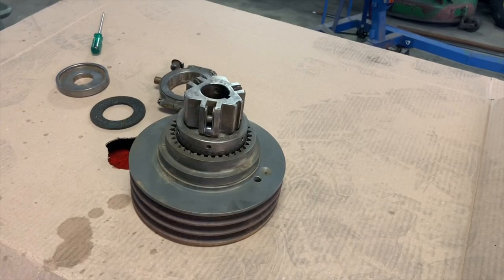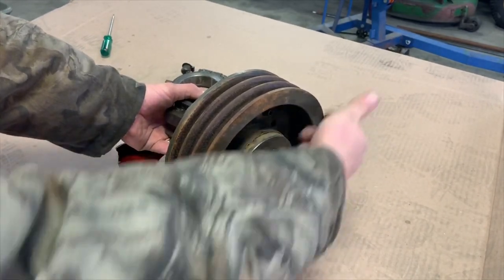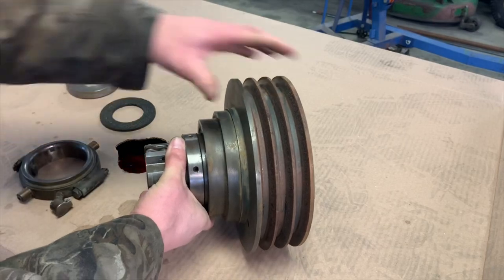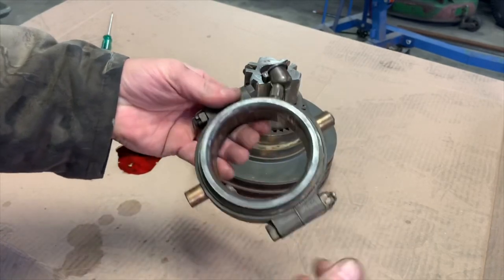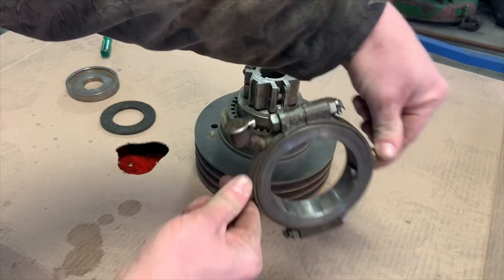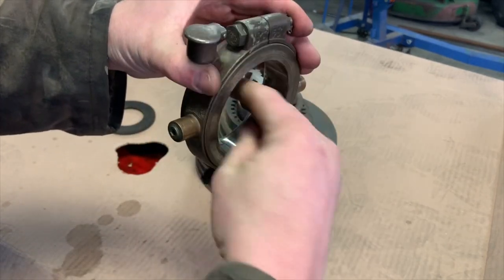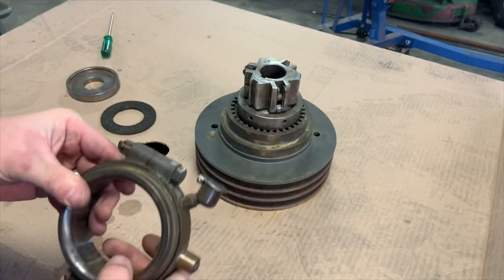Here are the same parts. This is the pulley — the belts drive this. And this is that collar that was going back and forth. There's the oil cup. Let's take a good look at this yoke — you can see it slips inside of itself. It's held by two brass bearings right here and then just shifts side to side, attached to the lever on the front of the machine — that's what engages and disengages the clutch. There's usually a piece of felt in there that holds the oil, and since this is constantly turning while the machine runs, you want to keep it oiled.